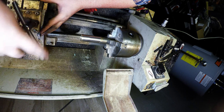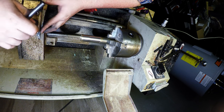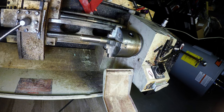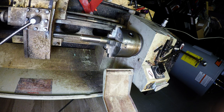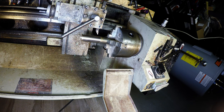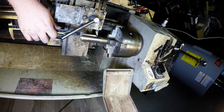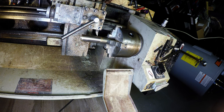So my touch hole is going to be about 49.5 millimeter up, and I want my ejector, because this is going to look like a bullet when I'm done with it, in a reasonable location that looks good. But I don't want it like on the last one. I put the touch hole inside the ring, and I don't really like that now, because it was hard to clean up. So, put my ring about there.